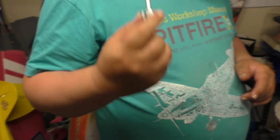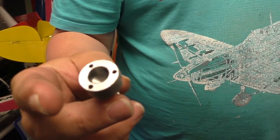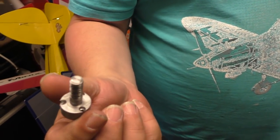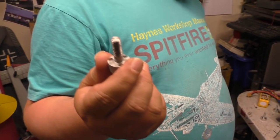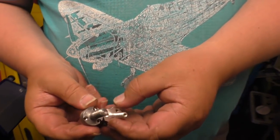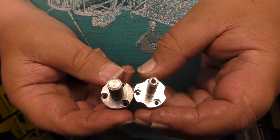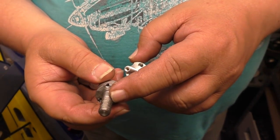Terrible. So we needed to rectify the situation, didn't we, Colin? Yes, we did. So we made this, out of steel, on the lathe. The lathe saves the day yet again. This is EN58J steel, rather than crappy Chinese aluminium. There's the original, and there's an RC Model Geeks version. Much more chunky. 8mm shaft now instead of the 6.